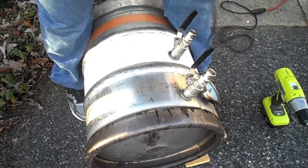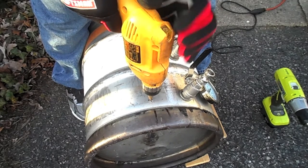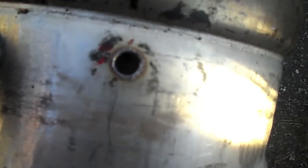I'm going to stop filming for the step bit portion because it's pretty loud. When you're doing this, make sure if you have a leveler on your step bit that the bubble is square before you start drilling. I was checking whether the port would fit inside the hole — it should be about a half inch — and I just dropped it in and it worked. Now about the gloves: these are brand new gloves and it got so hot around the hole that I actually burnt some of the material on the edge of the glove. That's how hot it gets when you're drilling.